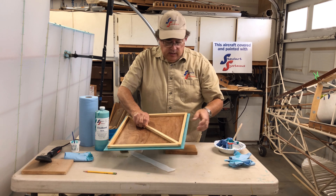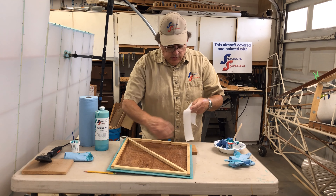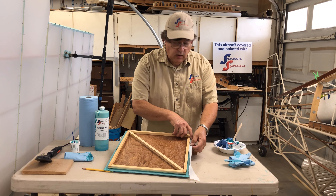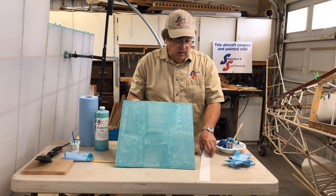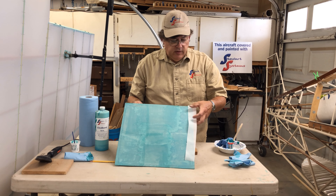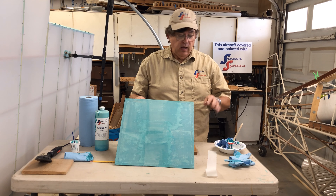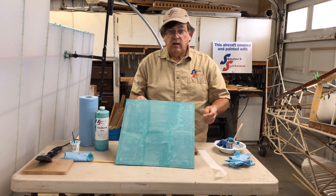I've got the entire surface bonded — the fabric bonded to the plywood very well. Looking at it from an angle, there are no bubbles; even the lighter areas are not bubbles in any way. At this point I want to let this tack up completely, dry for a couple of hours, then go ahead and put on any finishing tapes around the edges if you're going to do them. Cut your tapes, apply a fresh coat of glue inside with about 230 degrees, bed the finishing tape in with the iron, fold it over across the face, then apply full-strength glue with a wipe on top of the finishing tape. The main reason for the finishing tape is just to give some more strength and abrasion resistance by having two layers of fabric.